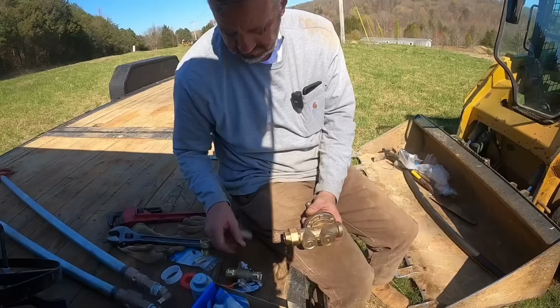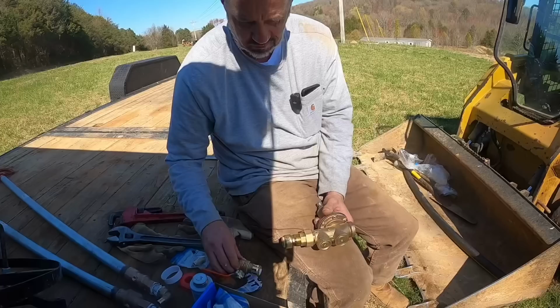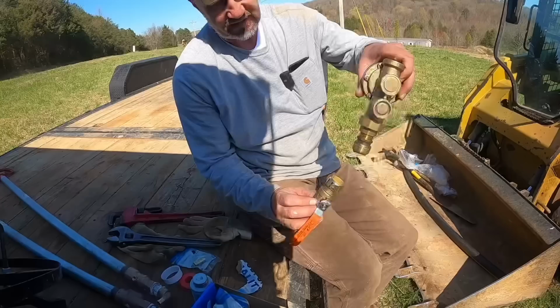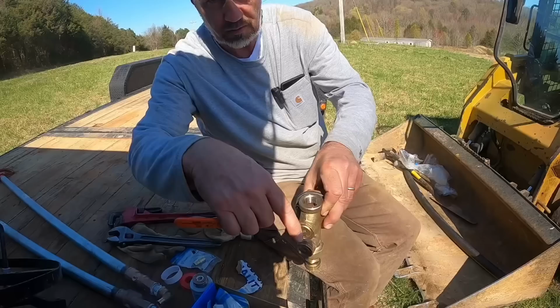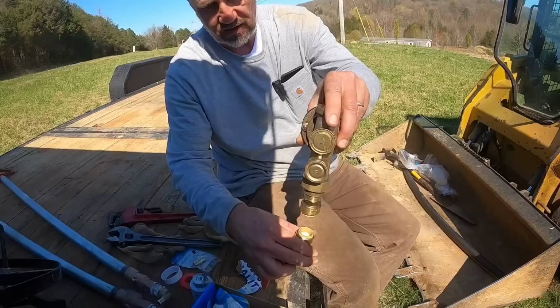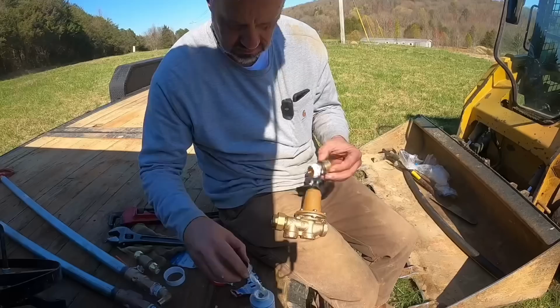So what I'm gonna do is use a SharkBite with a male end, and I'm just gonna simply screw that in there, put tape and pipe dope on it. Then take a short piece of PEX and connect these two together like this. And then it'll actually be like this. Down here at the bottom, our PEX main line will come in there, so that'll hook up like that, and the top part will screw directly onto the fitting that the mobile home company provided. So that screws onto that short piece of PEX, and then our main line PEX coming in the bottom. Just like that, I'll get this tightened down,